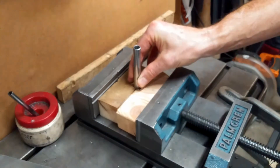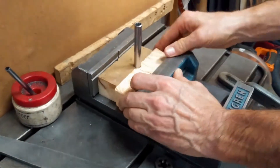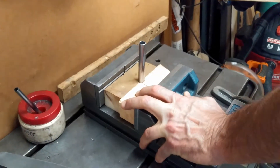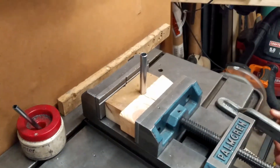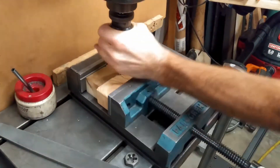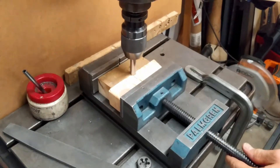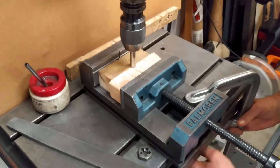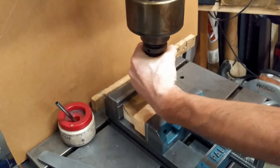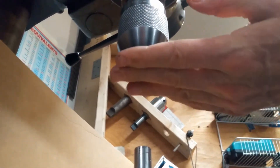So what we're going to do is stick it in these blocks and make sure it's in there super tight. I just cracked the block, which means I've got the right size. The concept is to get the drill chuck to go over the top of it, tighten the chuck down until it's nice and tight on the rod — that just gives us a location to hold it there while we put the clamp on. So we get the clamp nice and tight, then undo the chuck so it comes loose. Now we're looking underneath — I've got the jaws down below this surface so that it makes a nice flat surface.